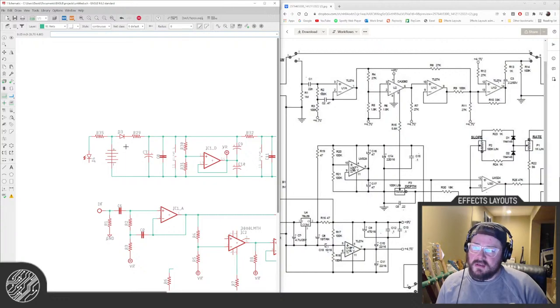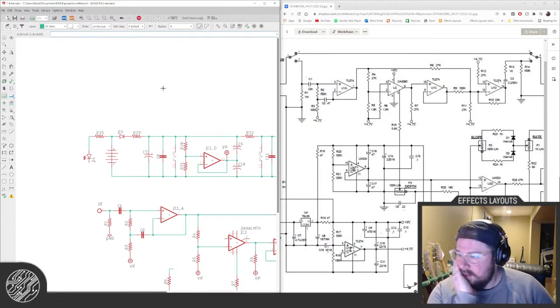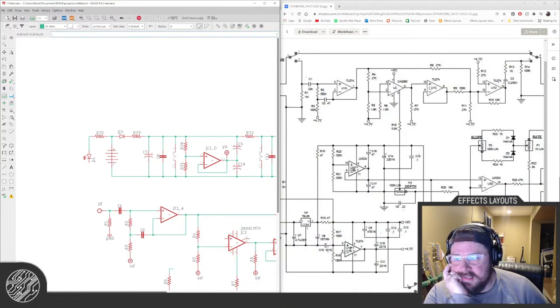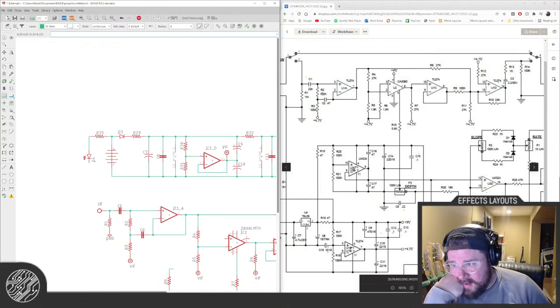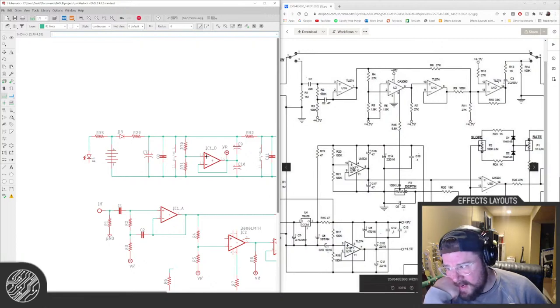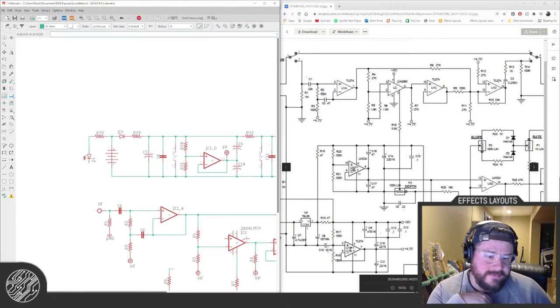I was tempted, if we were going to stick with the LM13700 or whatever, to take out this op amp right here and use those Darlington transistors that are in the LM13700. But if people can get the 3080, it kind of... Yeah, and then I wouldn't have a buffer for that VREF if I changed this, because then I could make this into a dual instead of a quad. We're just going to leave it the way it is.